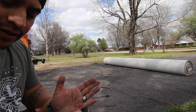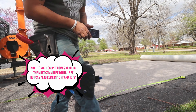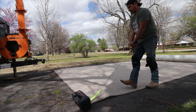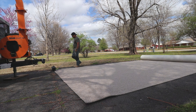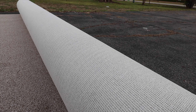We've got our chalk line here and we're getting started. We've got our 12-foot roll of carpet here. We started by unrolling and measuring — make sure you write down your measurements. Our first one is 13 feet 6. If you have someone to help, this is definitely easier with two people, but I just used a toolbox to hold it on the edge. I made marks on both sides, cut a little slit on both sides of the carpet, then rolled it back. We put the chalk line in and ran it over to the other mark to line up the cut.